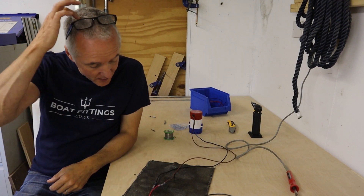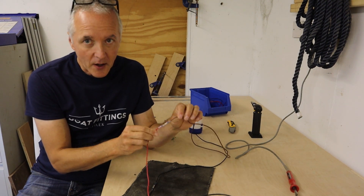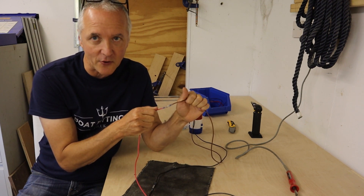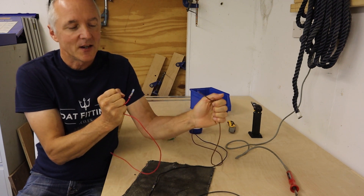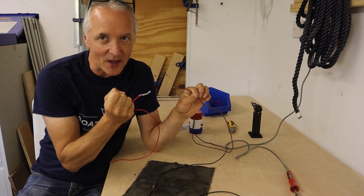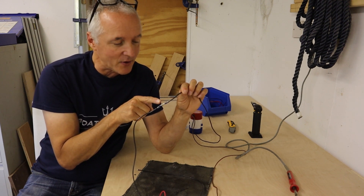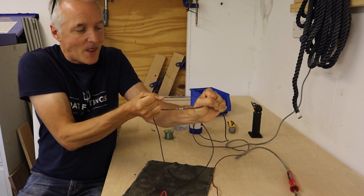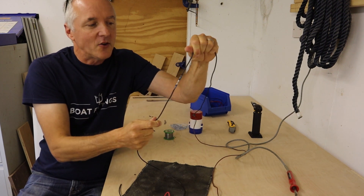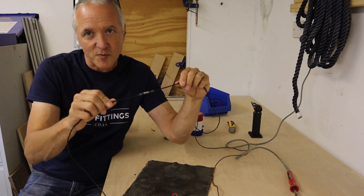We've got both joints done. The red one was just heating up the solder butt connector with no pre-soldering, and it looks like a well-sealed joint — but the question is how strong is it? Has the solder flowed? Has it really mechanically joined the two bits of wire together? I'm going to give it a pull. Unfortunately, even though it would have made a good electrical connection, they're not mechanically very well joined together. The black ones — I pre-soldered, then brought the solder butt connector over the top — and I'm going to give those a pull. I just can't, without hurting my fingers, pull these apart. So there's a good, strong, robust connection, well sealed and the ideal way to extend wires in a waterproof way that you can rely on.